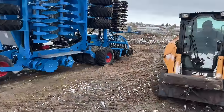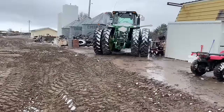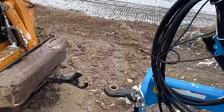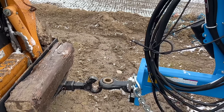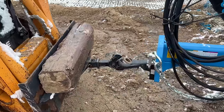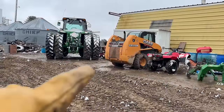I'm going to help hook up the grain drill, then hook up the chisel plow, then the manure trucks — it's just a never-ending process. We got the skid steer to lift the drill up because it settled in the mud and the hitch isn't quite tall enough to go onto the back of the tractor. We need to lift it up and put a block underneath. Looks like it might be able to hook right under that. Lifted it right up — got to go up a little bit more, we're going to try and put this big block underneath the jack.